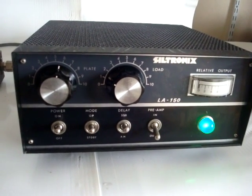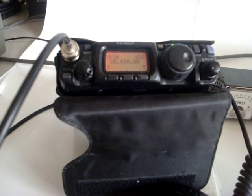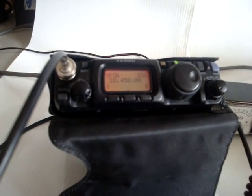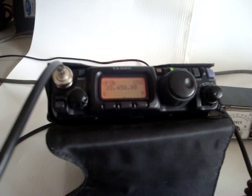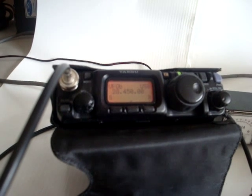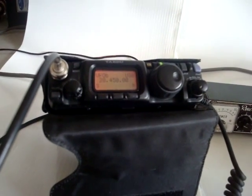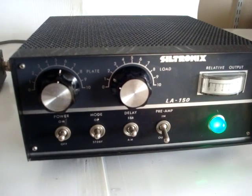I have it currently adjusted at 28.450 MHz. As a driving rig we're using the Yaesu FT817, a set that gives off about 4 watts PEP as a maximum — either 4 watts FM, 1 watt AM, or 4 watts PEP single sideband. So 1 watt AM carrier is basically 4 watts PEP as well. This rig can drive the amplifier to about 140 watts output, so it has quite a lot of gain — about 15-16 dB.